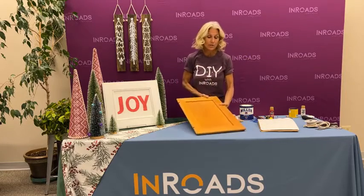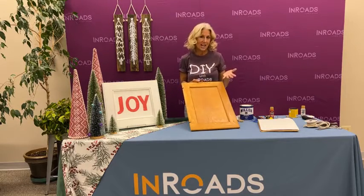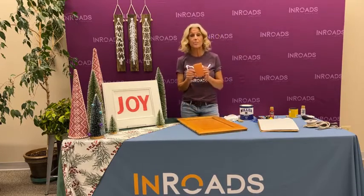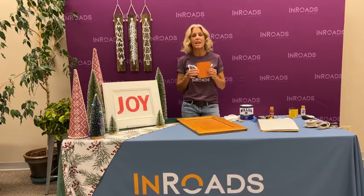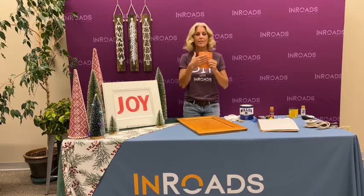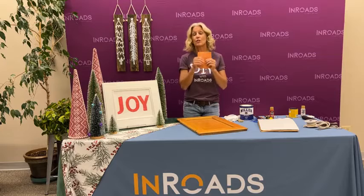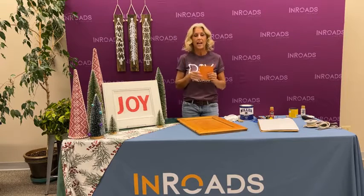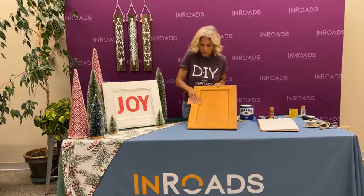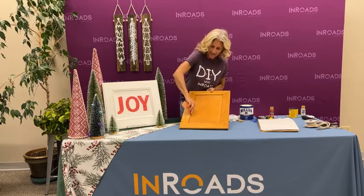Now, the first thing you wanna do, because pretty much all of the cabinetry has a seal on it, a finish, so notice if it's shiny, and if it's painted, it's gonna have a sheen. So you definitely need to take a piece of sandpaper, and the sandpaper that I like to use is like a 100 grit. Now, if you don't understand what grit means on sandpaper, the higher the number, the smoother the sandpaper is. So this is a 100, 150, then it goes 200, 220, it even goes down to like 60, which is really coarse. So very simple, all you wanna do is just rough up the varnish, or the seal that's on that, and hit it a little bit.